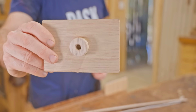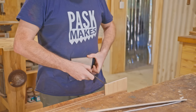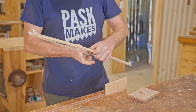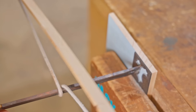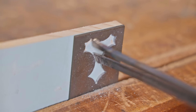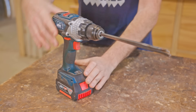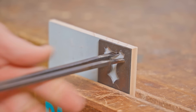First I'll show you how the original tool would have been used. A plate would have been worn around the waist to hold one end of the cutter, allowing the user to put pressure against it and the workpiece, and then a bow would have been used to drive it forwards and backwards, allowing the cutter to get right into the corners of the template. Even though that's very cool, it's much more convenient to put it in a cordless drill. I'll have to run it clockwise and anti-clockwise and may need to try different speeds and techniques.